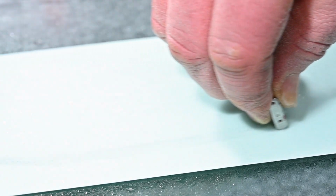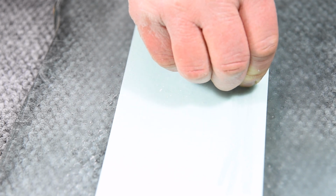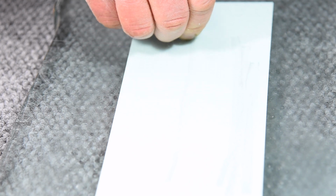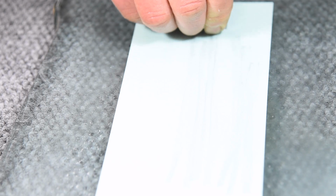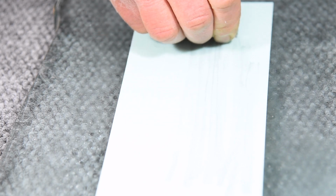The thing about lapping is that it needs to be done with a clean surface every pass. And one of the ways to do that is to flood the lapping material, in this case the film, with the fluid, something to flush it off with. This can be done under a sink. It works really well, or outdoors with a garden hose or something like that. In my case, it's kind of hard to do that and film it at the same time. And of course, right now it's about 23 degrees outside, so I won't be doing that.